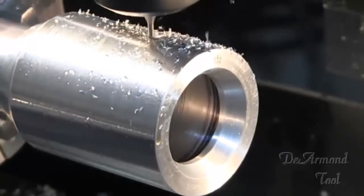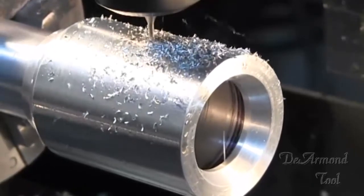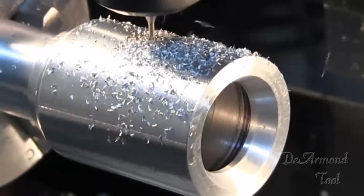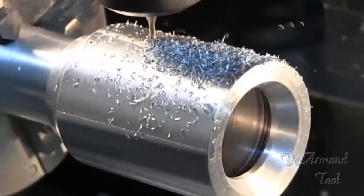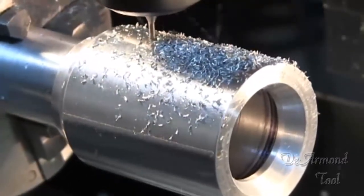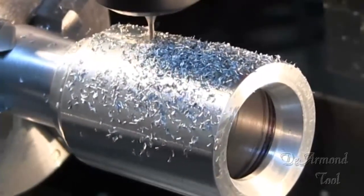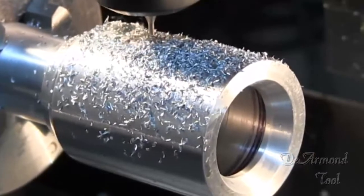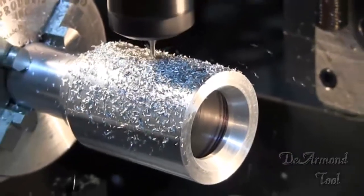I have to tell you here, we're breaking every machining rule known to man. This cut is way too deep, the spindle speed is too slow, and the linear travel is much too fast. The forces on this tiny tool are massive and change directions in split seconds. This isn't for the faint of heart and can really spell some disaster.